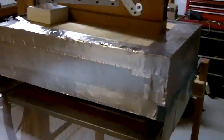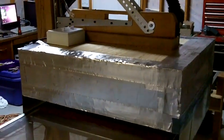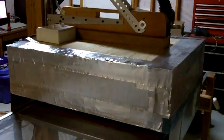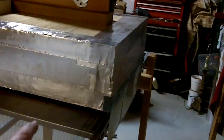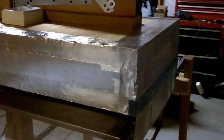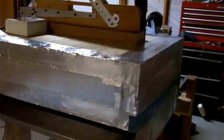Subsequently you'll see some plans I've promised on how to build this oven — it's not really a complicated thing to make, but there are some details to pay attention to. This material here is called Thermotex; it's a sheeting material with a high R-factor and can take up to 250 degrees of heat. Our bulbs are right at the level of this, so we're not getting the full amount of heat on the sides to begin with.